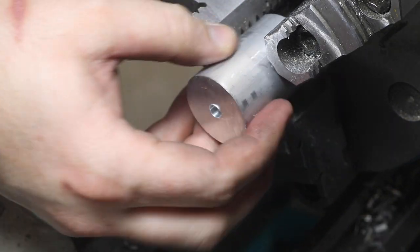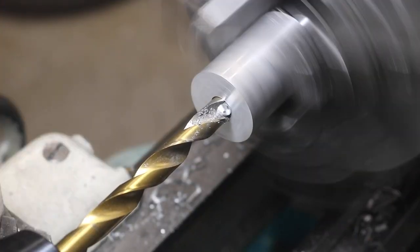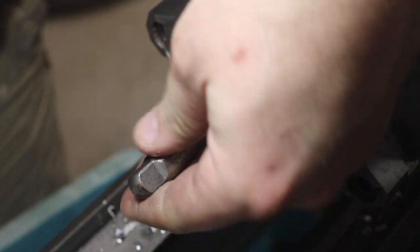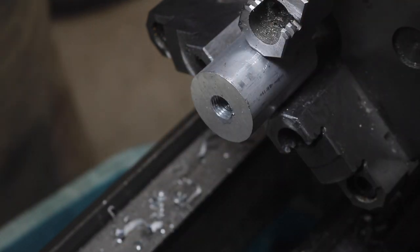After flipping the part, I apparently decided to drill the pilot for the NPT tap before facing, and I'm in my own comments section on this. That's bad practice. It's driving me nuts.